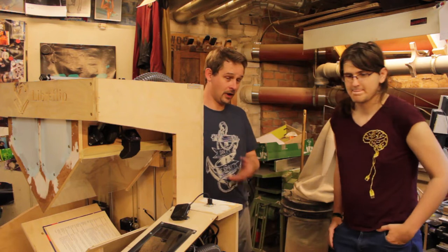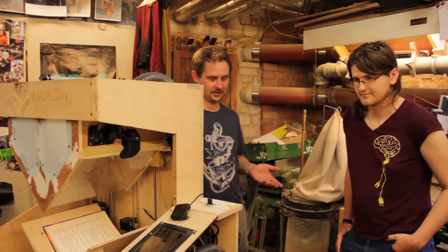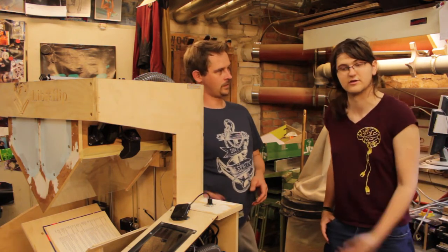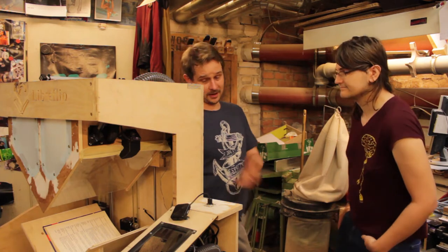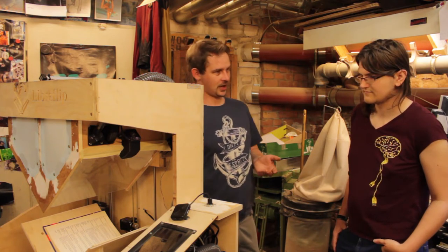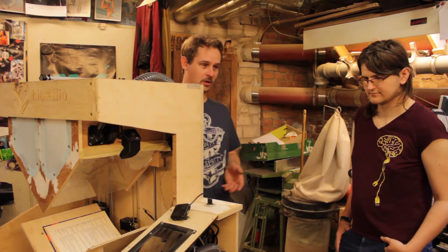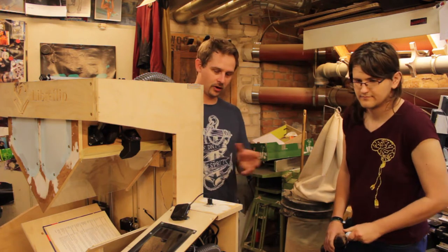All of these options have to be discussed on our side too, because they come with a lot of work — some more than others. There's obviously a cost involved in manufacturing PCBs, plus design implications. Making one on your kitchen table is a different process to manufacturing them by the hundred in a factory. Making this machine super silent is actually possible with a custom PCB — we could put one of those fancy Trinamic drivers on the PCB, which would allow us to drive the stepper very, very silently. Right now it's rather noisy.